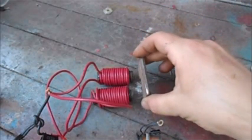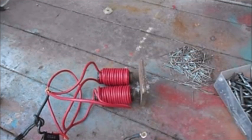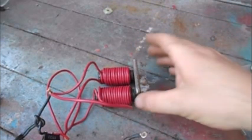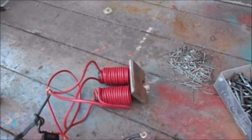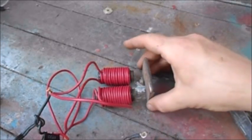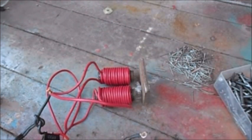Let's pretend this is your armature bar — here are your two electromagnets, your coils. Your machine is pretty much turning on and completing the electrical circuit every time the front spring touches the contact screw. Then as soon as your armature bar gets pulled down, you lose contact with the front spring and it turns off, so your armature bar goes back up. Once the spring touches again, electricity goes back on, then off, and back up — your tattoo machine is just turning on and off over and over, super fast. That's how it works with your electromagnets.